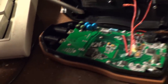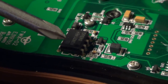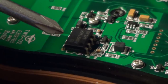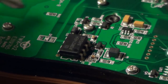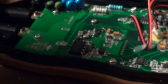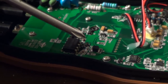We move our attention over here to this eight-legged dual inline package chip with the Matsushita logo on it. This is actually a solid state relay and is very likely the heart of this meter's ability to automatically change its range of measurement from resistance to voltage when in fact there is a voltage applied. I suspect it would be quite difficult to trace exactly what results in the switch being made, because this is a multi-layered circuit board. My guess is that this transistor right over here plays a key role in switching that relay so that the appropriate mode of measurement is selected.